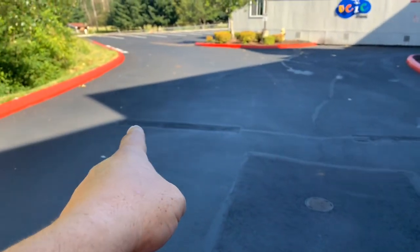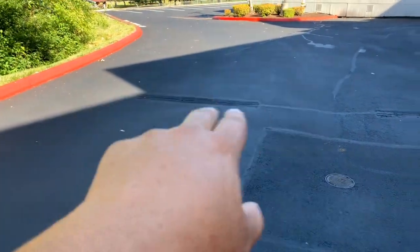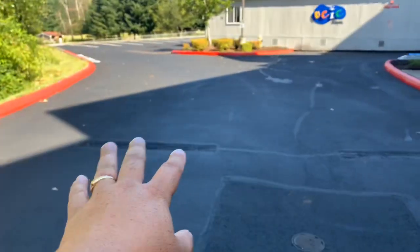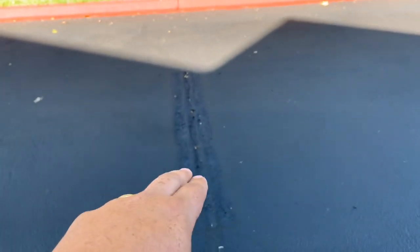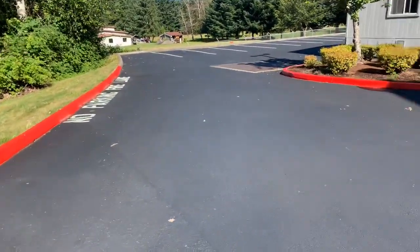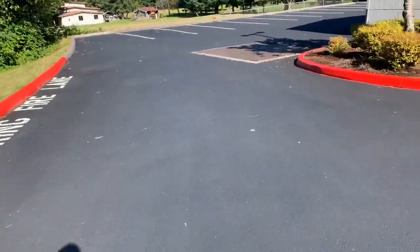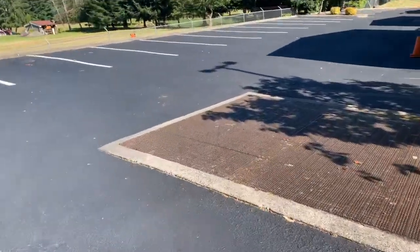What we want to make sure is that we cover over the existing speed bump areas that used to be covered with plastic speed bumps. Okay, so we want to make sure that we're putting this speed bump over the top of the existing locations, so it doesn't show this right here, because you can see that it's all washed away over the years. Water got underneath, and all the vibration and pounding of the cars going over it, it just wore down the asphalt. So we definitely want to make sure that we're covering those existing speed bump areas. Do not leave any of the old area exposed. Okay, so that's 4 speed bumps I've shown you.